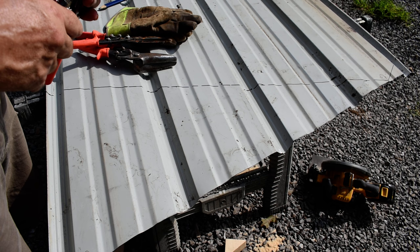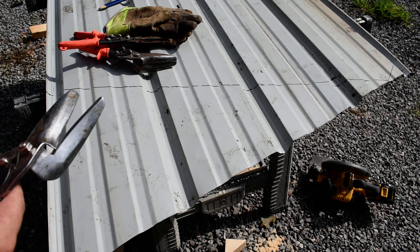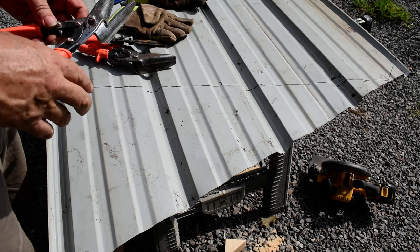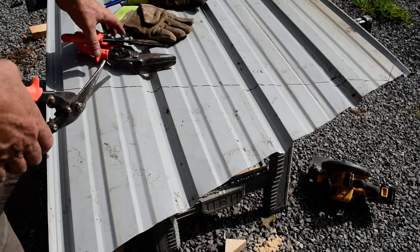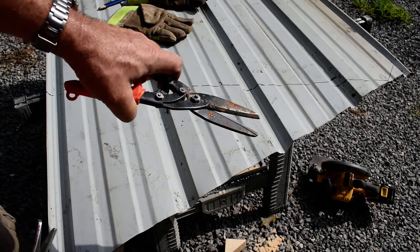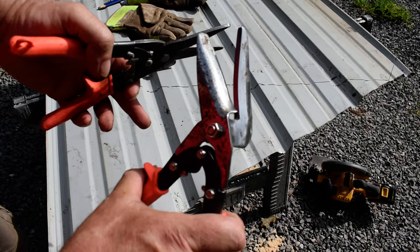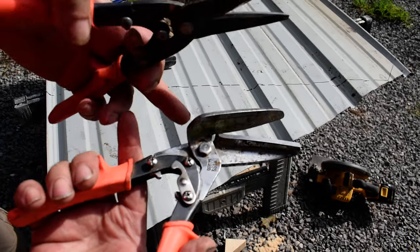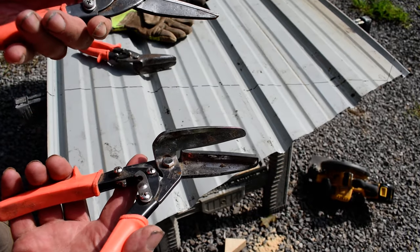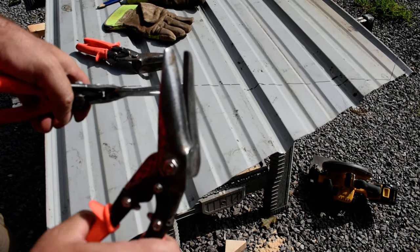I started doing metal roofing and I've got every tool imaginable. I've got a power shear, I've got a number of aviator shears, I've got cut-off blades. What I found, you need a 4-inch pair of snips, but you need them offset like this. This is a Wiss model M400. The 300, the metal gets in the way, so this is the pair that you want to buy.